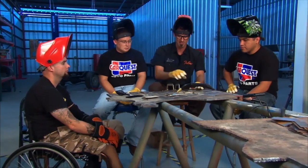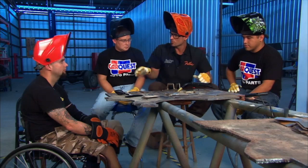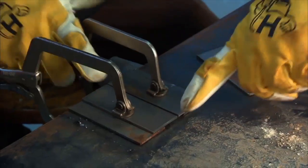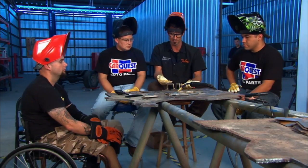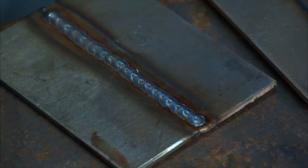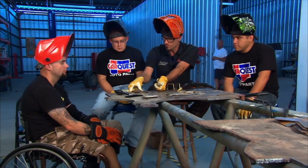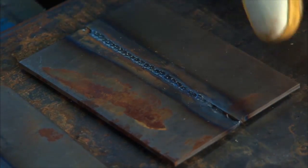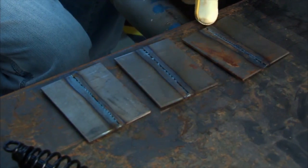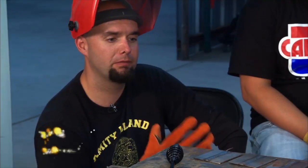Welcome back. They're finishing the welding on our table over there. I want to get you guys set on some coupons — we've got some eighth-inch pieces here. The big deal is you don't want to have it sitting on the table itself because it's going to be a heat sink and you won't get good penetration — it'll totally change all your settings. Space it off a little bit. These are setup steps I did to get the heat right. That looks good on top, but if you look at the back, you're not getting full penetration. Now on the third one — that's what you really want, because that penetration means you're getting a full weld all the way through. Not only your heat settings, but your gap settings are important.